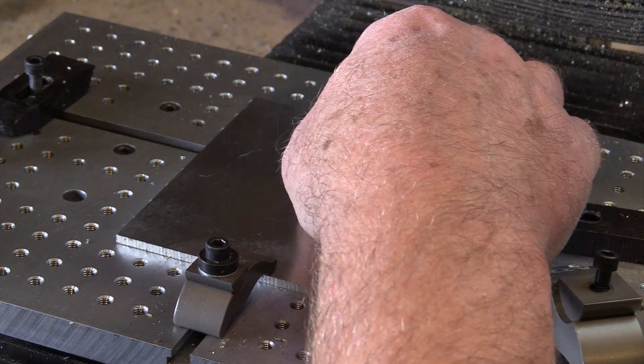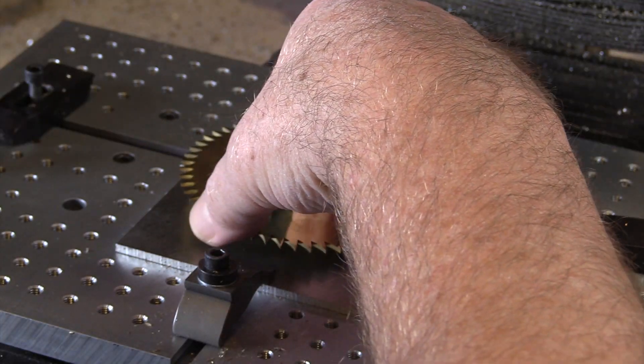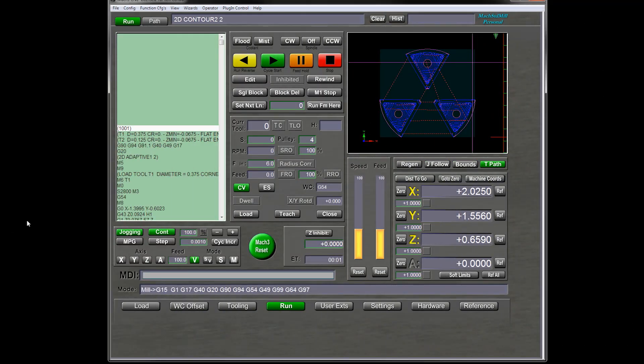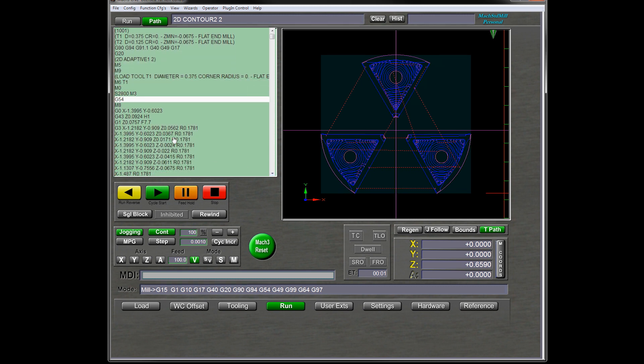Now I can take the dowel pin and locate it in that center position. And once it's there, I can mount a gear on it knowing that it's centered. Once we've chosen that point on the physical machine — this is the machine controller — you see where this crosshatch is? That's where the machine thinks the cutting tool is right now. We want it to be at zero, so we say X is at zero and Y is at zero. Now the machine knows that all of its moves laid out in the G-code, all of these XY instructions, are going to be relative to this center point.